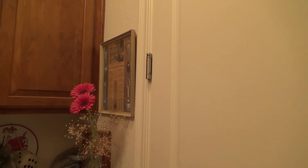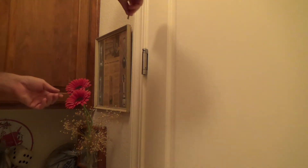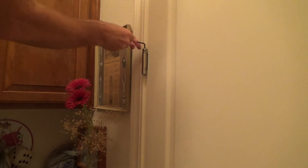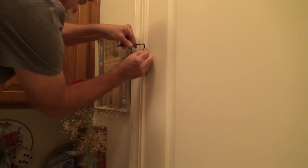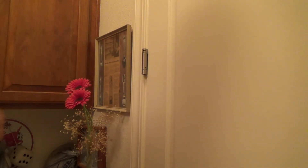This video is about how to get your door so it doesn't slam, but it also works the same way if your door is not closing all the way. So now I pull the pressure off, pull the pin out, and put it in the next hole to tighten up. All I'm doing is tightening up that spring in there. If you don't have one of those pins, you could take a number six penny finish nail, cut the end off, and use that as your pin.